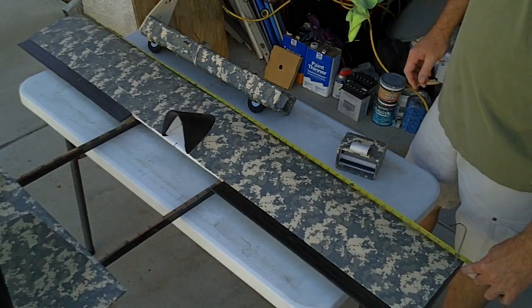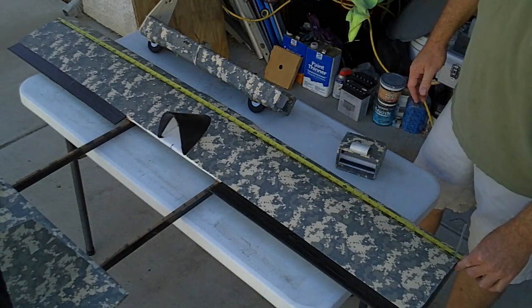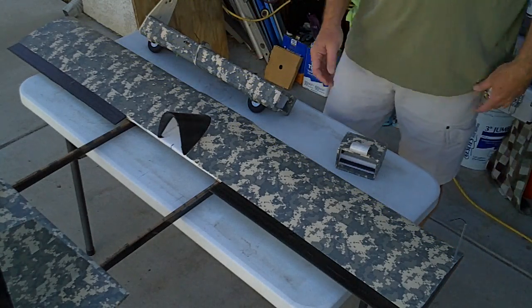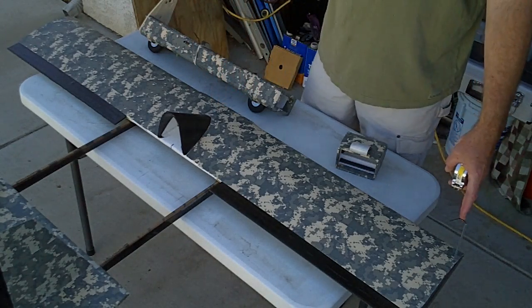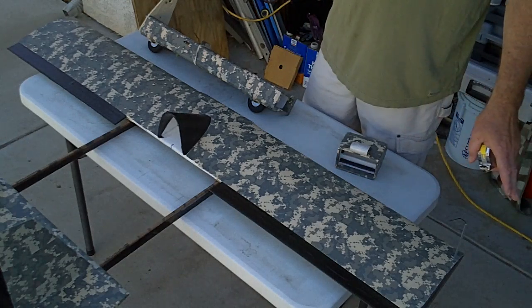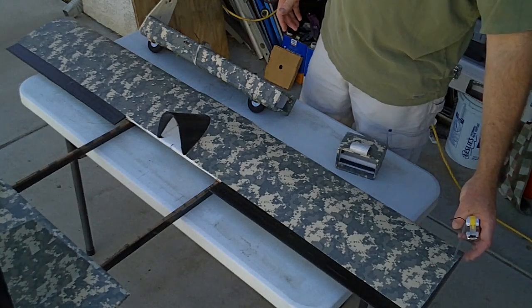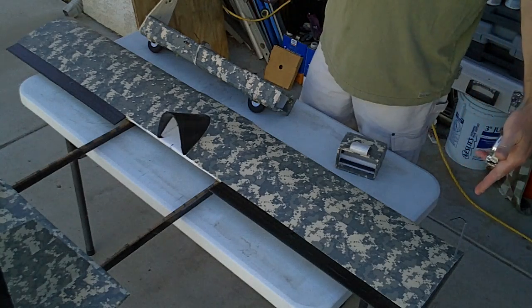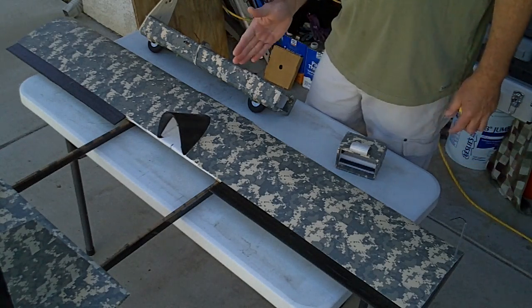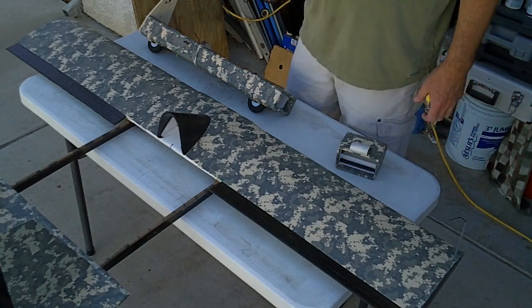Okay, so overall wingspan is two sections of the arm and wing. It ends up being 60 and 5/8, which is not really all that important. What's important is that it's two full sections of the 30-inch Dollar Tree foam board in here. So a total of 2 panels or 60 inches. The reason it's longer than that is because I have 1/8 inch skin plywood skids on the ends that add some length, and the panels themselves are not exactly 30 inches. I've noticed they're 30 and an eighth sometimes, so this particular one happens to be a little bit bigger than that.